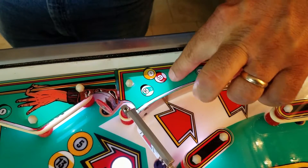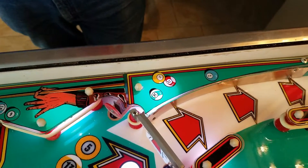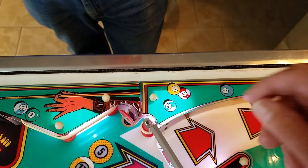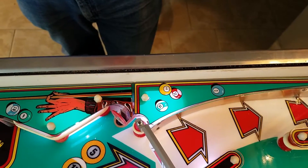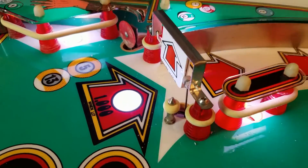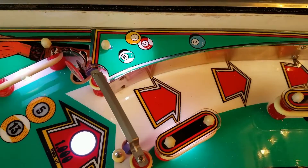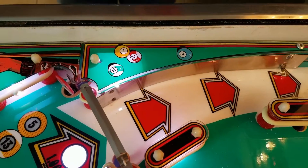The GI light mounted under the table is not lighting up this entire strip like a normal GI light that sticks through the table would. Normally the GI light sticks through the steel on the side, which keeps the light from shining out on the table but lights up the whole green space. Our LED being so directional and mounted so low isn't doing that.